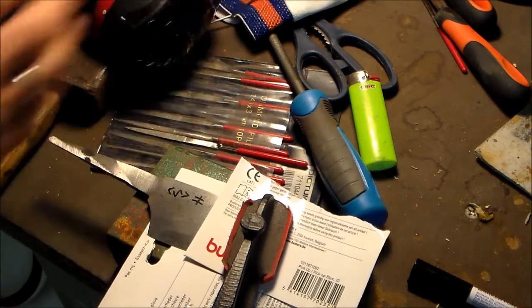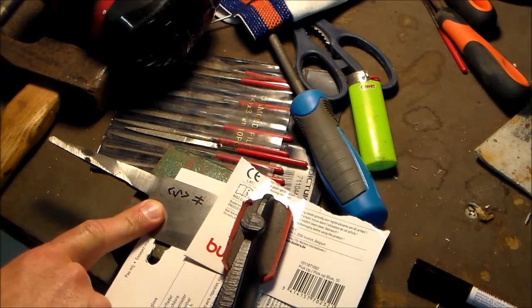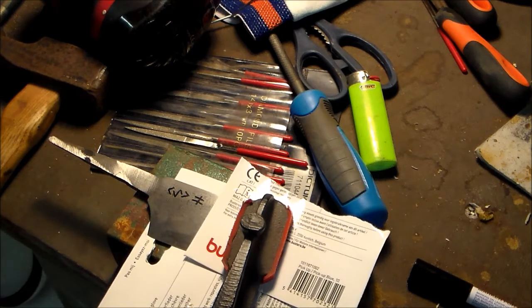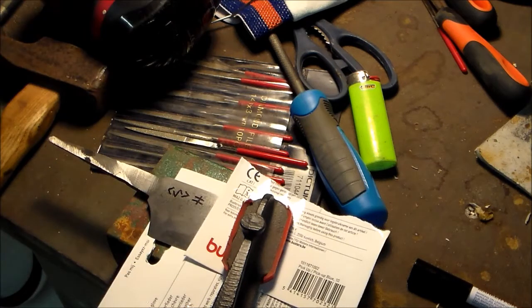Oh, and one thing, because this is a rather thin knife, well, compared to the tang of a razor anyway, I tap lightly to avoid displacing a lot of metal in one go, because I found that if I hit hard and I make deep marks, then during quenching the blade will bend around here because of all the metal that was displaced cold.